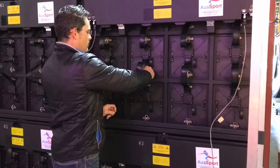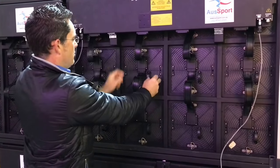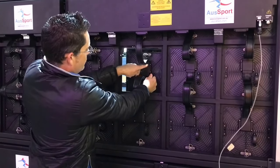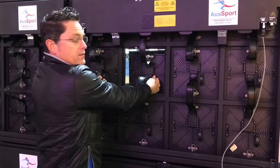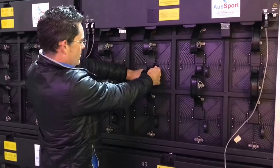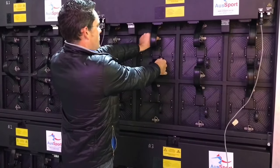From the rear, all you need to do is turn one, two cam locks and the module comes out the front. There are four Phillips head screws — unscrew that and the comms cable comes off the back, then swap the new module in. And to reseat it, turn those two cams again.